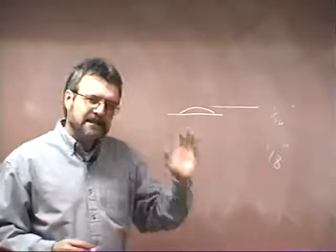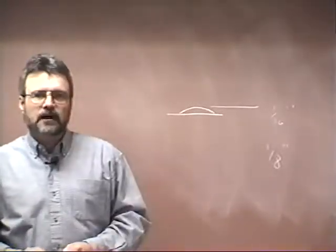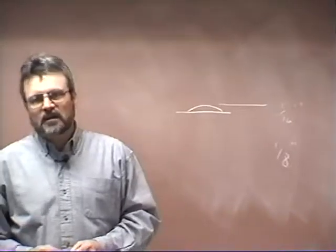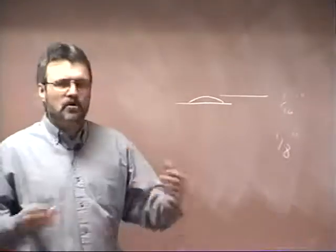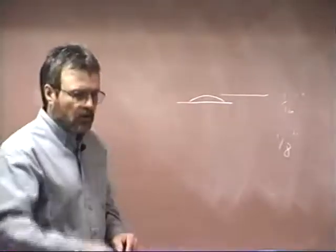And you want it to be nice and consistent, a nice consistent bead. You don't want interruptions in it. You don't want lack of fusion. You don't want lack of penetration, any kind of discontinuity. You don't want toenails in it. So you're shooting for 1/16 of an inch with a nice continuous bead all the way around.